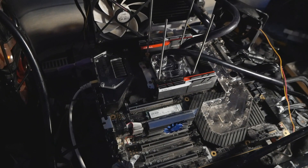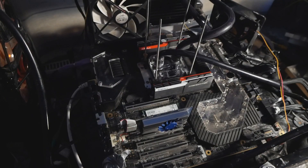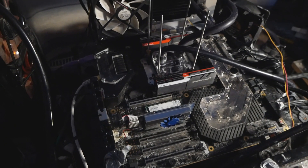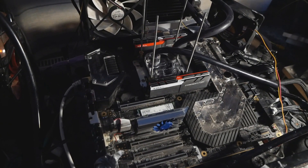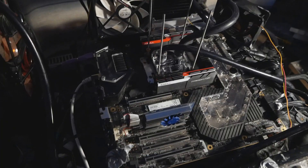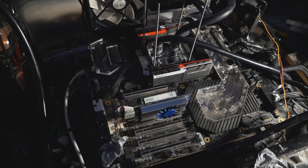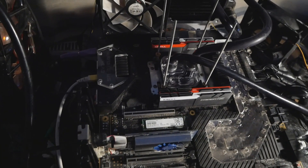There are two ways of doing this: you can either short the blown fuses so that it will work without a fuse at all, or if you have knowledge about BIOS-modding, you can try to modify the BIOS to bypass the blown USB fuse issue. But it's much easier to just short the fuses, so I will show you what happens.